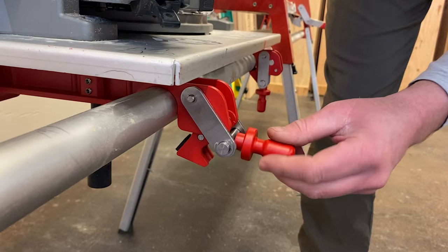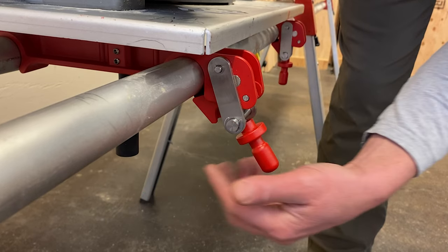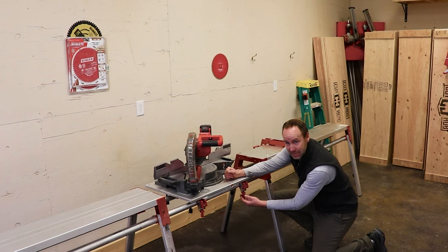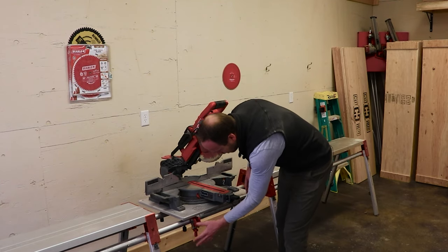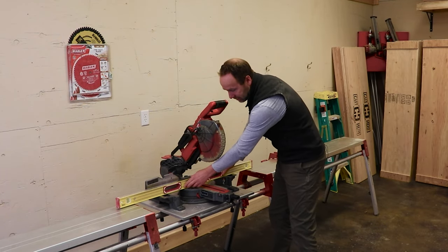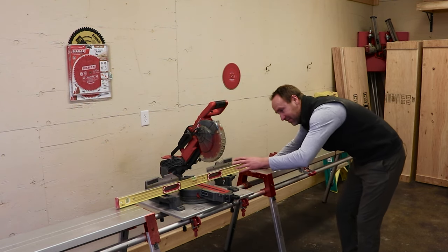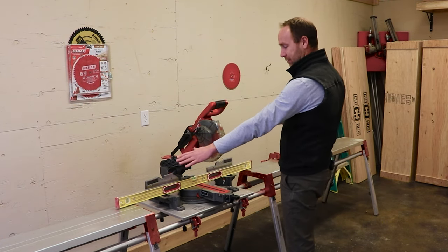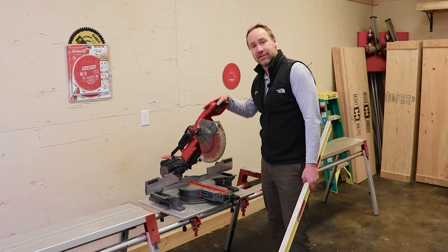With the other knob, you can see you just adjust it. If you're over-tightening it, loosen it up and you'll get the feel of it — adjust until you feel it engage with the pipe. We've set our table exactly where we want it and got it locked in place. The last thing I like to do is just double check — you can see I've got about an eighth of an inch gap here and here. That's really important so that the material falls away from the saw and doesn't bind. That's it — I hope you guys enjoy it. See you later!